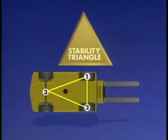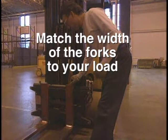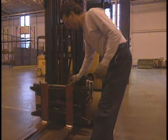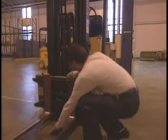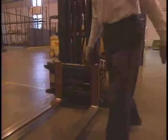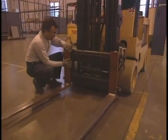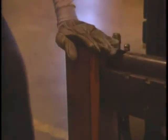In addition to understanding the stability triangle and load stability, you must also consider the position of the forks. To ensure stability, you should match the width of the forks to your load by actually adjusting the forks. For example, on this lift truck, you would raise the forks off the surface, release the fork locks, adjust each fork to the correct width, and lock the forks. Even with pressure to get the job done, it's important that you know and execute the proper safety procedures.